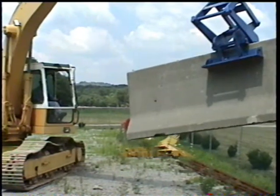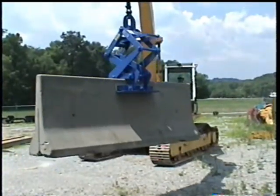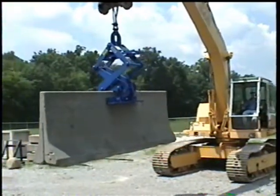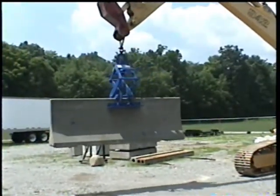Maintain a safe distance from the load. Never allow barrier lifter or wall to pass above any part of a person. Do not use a barrier lifter that has been altered accidentally or intentionally in any way without inspection by qualified personnel. Next, we will cover initial setup procedures.